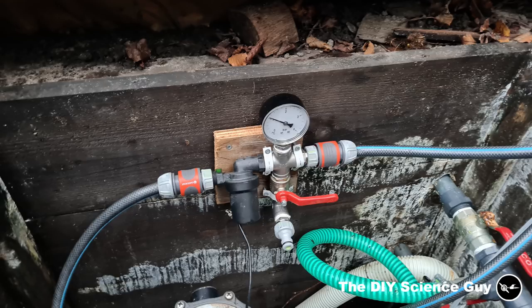I first filled the whole system with tap water because the high pressure and therefore high flow prevents airlock. For more information about airlock, I advise you to watch the video from Practical Engineering. I will put a link in the description. Then I pumped the antifreeze through and put the system under pressure with a bit of water from the mains.